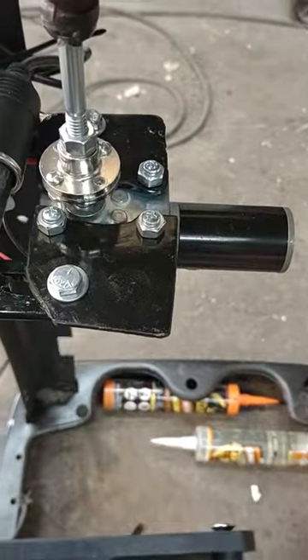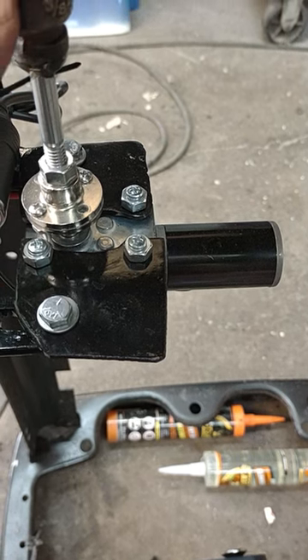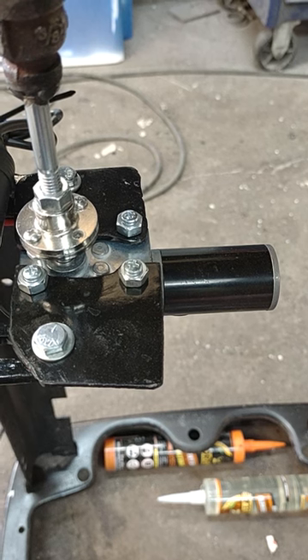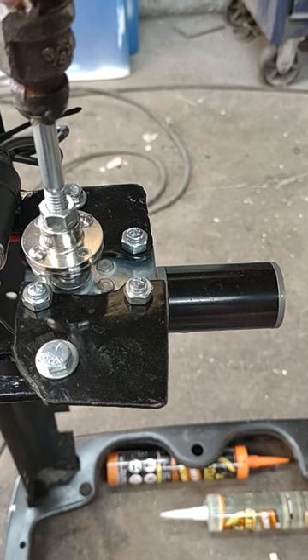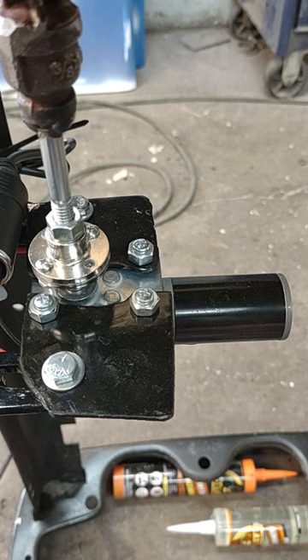It's a 12-volt motor, only about an inch and a quarter diameter and three or four inches long. It has a kind of D shaft, and I made this adapter. I tried an electric drill at first, but you couldn't keep the trigger steady and slow enough. What I like about this motor is you can get them in different RPMs — I bought a 30 to 40 RPM motor: 40 RPMs no load, 30 RPMs under load.